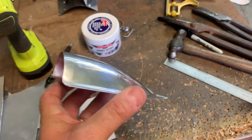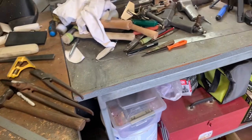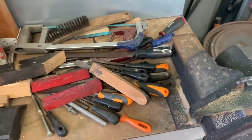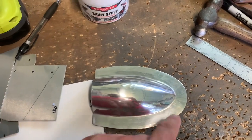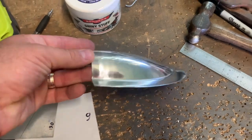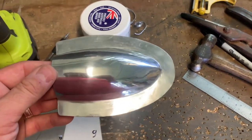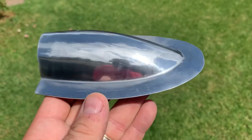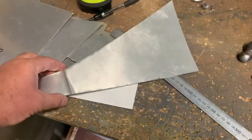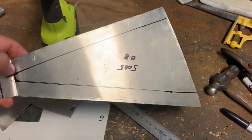A couple of dollars of aluminium from the local hardware store and a couple of hours of bashing and tweaking in the shed with basic tools - files, lumps of wood, and all that sort of stuff. Yes, I use an English wheel buried in over there somewhere, but you don't have to. These flanges and the way we did that is the same principle as any other flared fitting, like control cables coming out to your rudder and elevator - same principle. You guys can do this, just think a little bit and give it a go - it's totally worth it. Here's an interesting piece of scrap from before - I'll just mark it out and let's see what we can do with that.